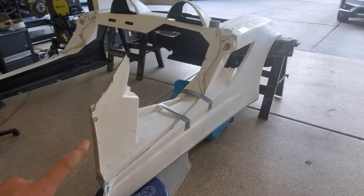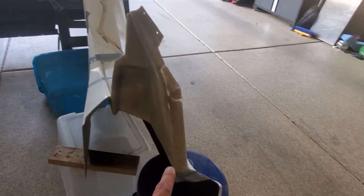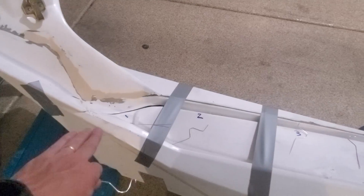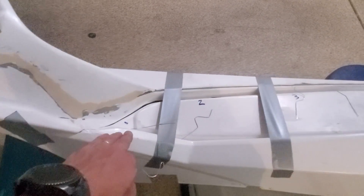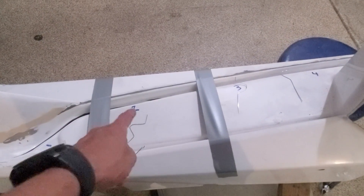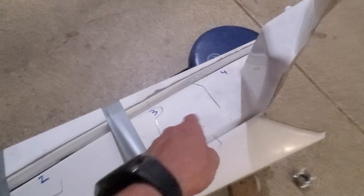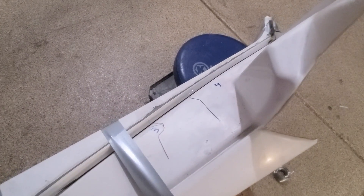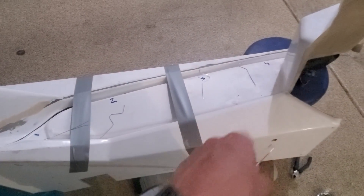Here at the shell I've got this panel roughly in place. I marked positions one, two, three, four, and five - I figure I'll do five brackets that I'm bending, plus one straight one here. I've got some aluminum wire that makes it really easy to form to the shape underneath rather than trying to guess at the shape. So shape two, shape three, shape four, shape five - I'm going to go ahead and do the best I can with bending. I don't have great tools but I'll make some to these shapes.